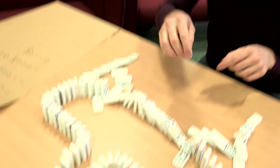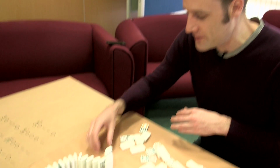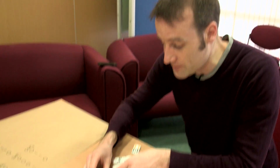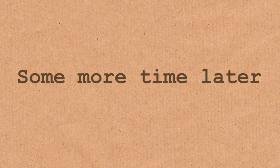So if I repurpose, because it needs an exclusive OR in the middle, if I very carefully... This is called a binary half adder. And the reason it's called a binary half adder is it's doing half of what you need to do full binary arithmetic. So if you can build what's called a binary full adder, which believe me we'll get to in a second, then you can do all the calculations you want. So a binary full adder is what calculators use, it's what computers use, it's the basis of all automated computation.